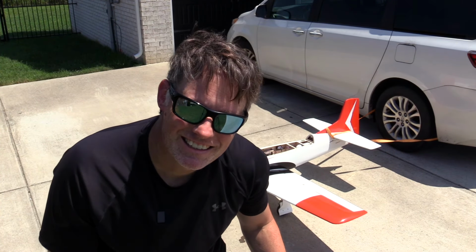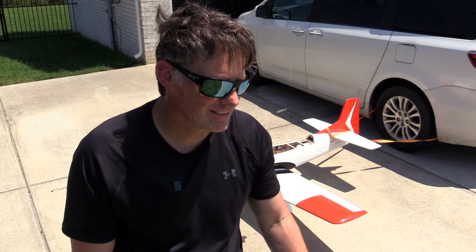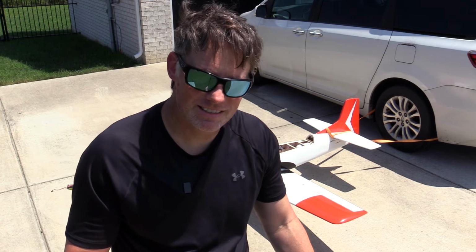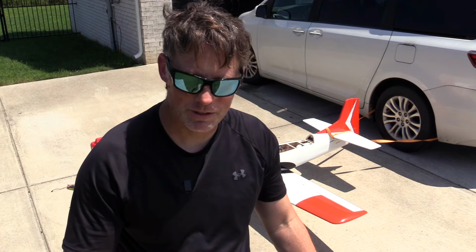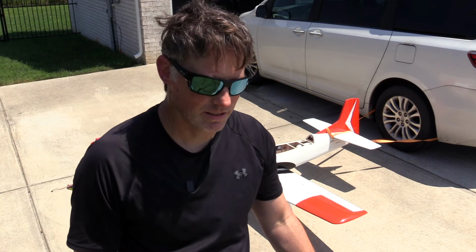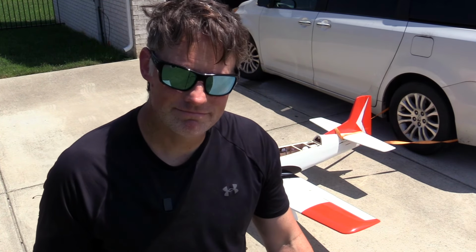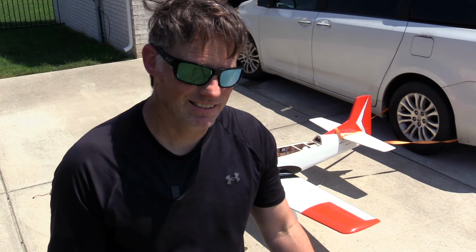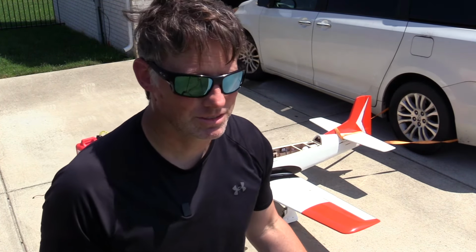All right, man. She runs. I got to run a bunch of fuel through it to break it in, but running it super fat, because that's what they recommend to start, just to help lubricate it. I don't want to overrun it. You can hear it really comes up in the RPM when it really gets on point with the mixture. So I'm gonna run a couple tanks through it before we fly it, and then yeah, I think it's gonna be awesome. It's got lots of pull, so it's gonna really fly good.